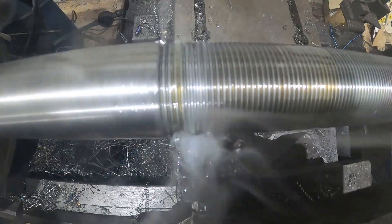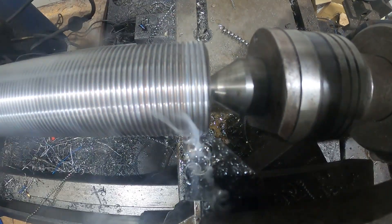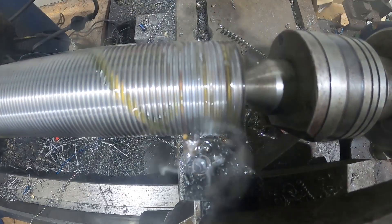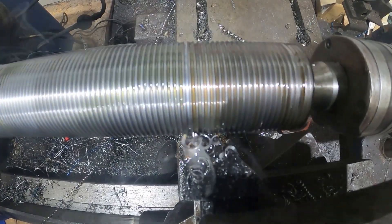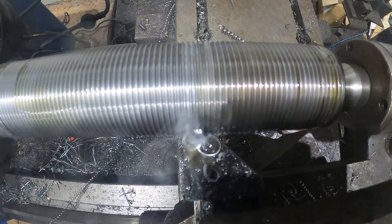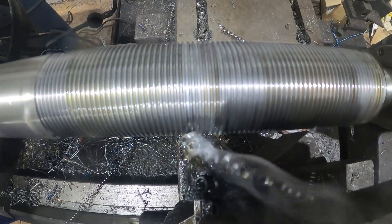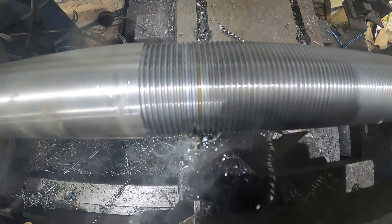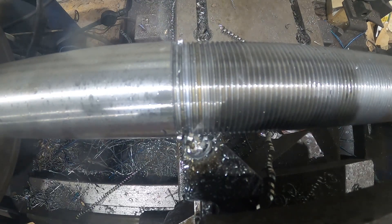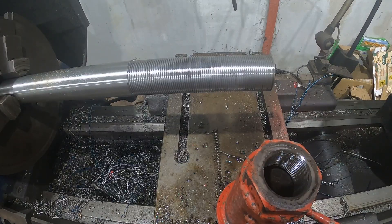The customer is a very good customer of ours, but when the phone rings it's normally the sort of job where you're going to earn your tea that night. We've just taken the final pass - this is called a spring pass - we've added a little bit of cut each time and on this last pass we're nearly at the right diameter. We're letting the lathe go across on its own without adding any feed, and the material it's removing is just from the spring in the steel and in the tool holder. The threads are looking really really good - nice profile, really pleased with them, especially in tough steel like that. We'd better just try it to make sure it's a good fit before we start drilling a hole and carrying on.